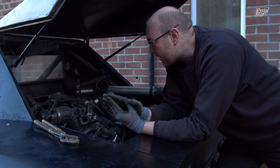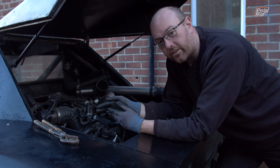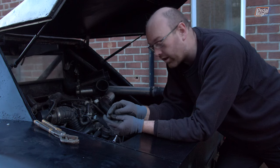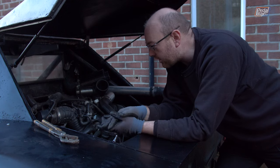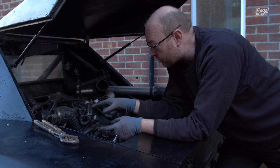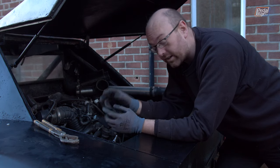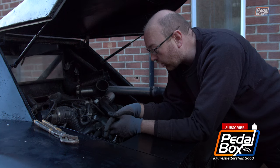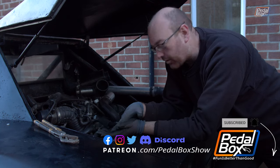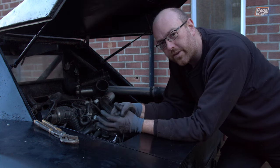But the other change we could potentially do is swap out those factory ends to proper rod ends, which might be the other winning move, again, to try and relieve some of the stiffness in the joints at the back here. We can just take this out. Next time we take the engine out, drill those two little ball pivots out and put some rod ends in instead, and that should solve a little bit more of the problem. But in the meantime, before we take this engine out again, there is still a lot more to do. As I say, we will see you in the next episode.